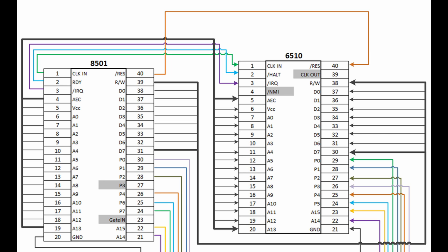The fact that P5 is an internal register in the 8501 bothers the mapping of the kernel. The kernel directly controls the input-output pins, the cassette, and the floppy drive, and they won't work until further modifications, because the 6510 and the 8501 have different input-output port mappings. But my goal is only to understand if the C16 works, so I can tell if it's really worth buying a $50 CPU.